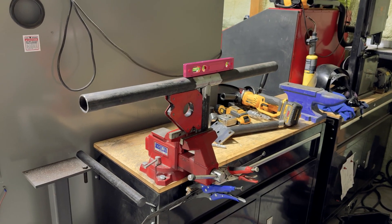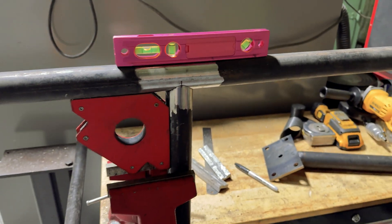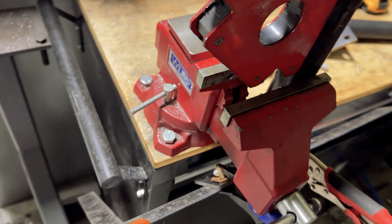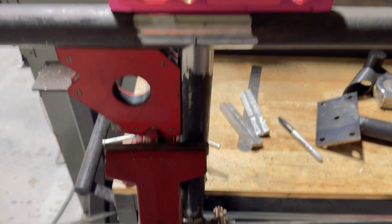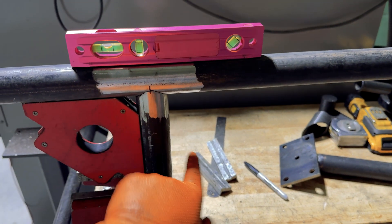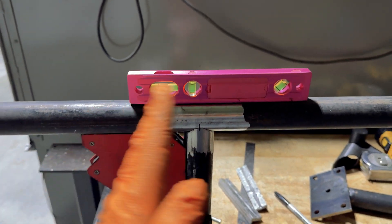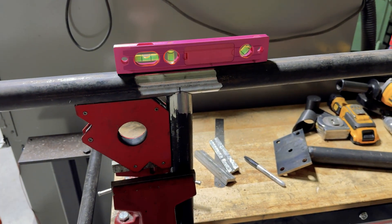Now we have to weld the skids on. You might assume that a 90-degree welding magnet would make it perfectly square, but it never seems to be the case. There are two things to line up here: the plate with the cross member. The way you get around that is to bolt something long to it — preferably not a square, just some long straight piece of metal. Look down from the top with one eye closed and check it's parallel all the way along. Then take your level, stick it to the vertical, check that it's mounted totally vertical, and put it on top to make sure the bubble's in the middle. Then put your tacks on, adjust, check again after tacking, and weld it all the way round.